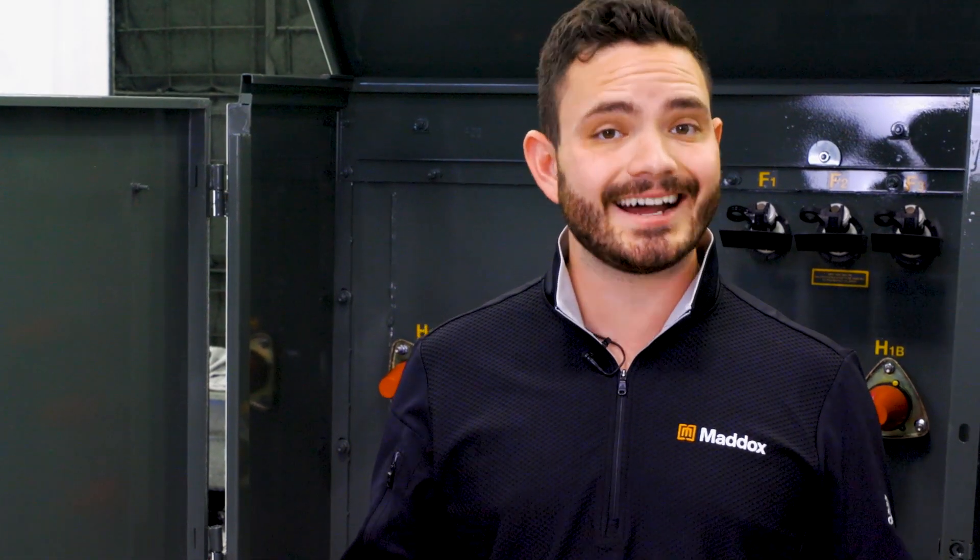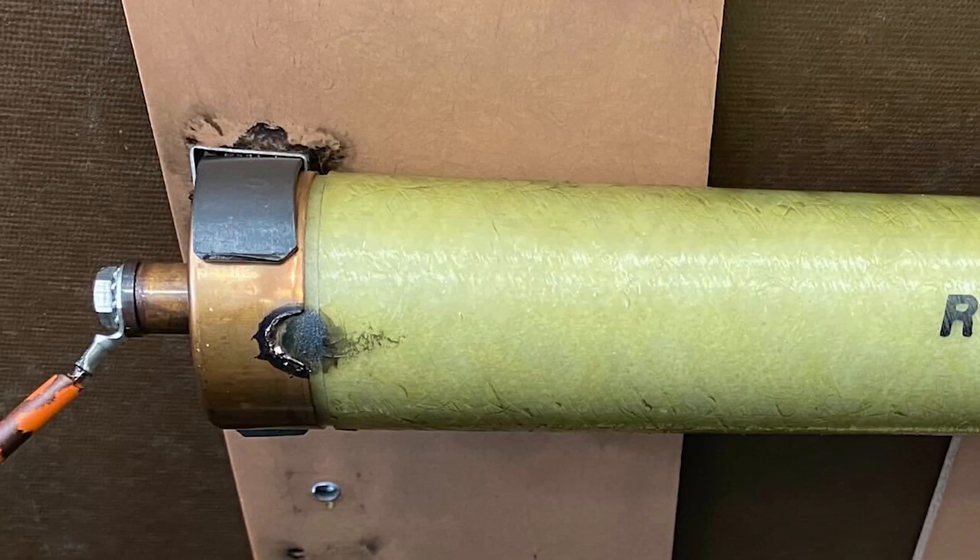It's important to note that CLFs are not intended to protect the transformer itself, but rather to protect the electrical system as a whole from a failing transformer. And once a CLF operates, it's almost certain that the transformer itself has already failed.